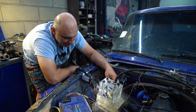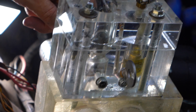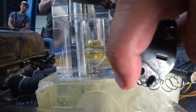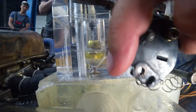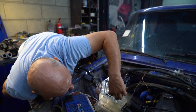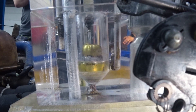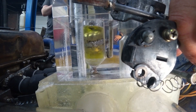Let's feed a bit more, shall we? It works great, I am really enjoying this. It expelled the gasoline — there's a bit left. Now if we look at the float chamber, the fuel level has dropped to below the channel. It ran out of fuel and the engine stalled. There we are — the fuel pump is filling the chamber with gasoline. Looking good. Let's start it once more.